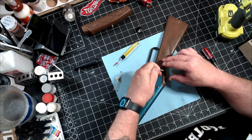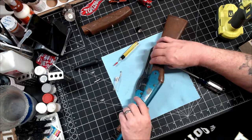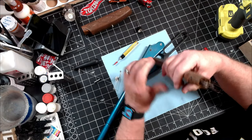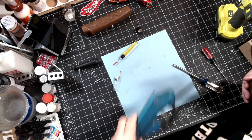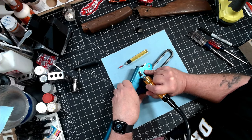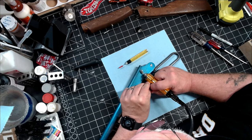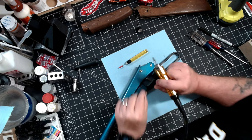I kind of thought I was going to have to paint the stock and the front grip, but they're really just going to need a good cleaning — so that's a win-win for me. With the screw and that rivet out, I can take this off. You'll see there are two springs in the stock: one is the trigger return, and the other keeps tension on the latching mechanism that holds the main spring back. I'm not even going to take those out — I'll just clean up around them and leave them right where they are so I don't mess it up. Now I can get my grinder out and attend to all the other little rivets.